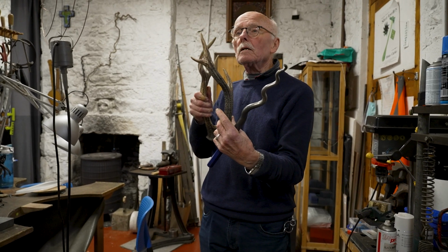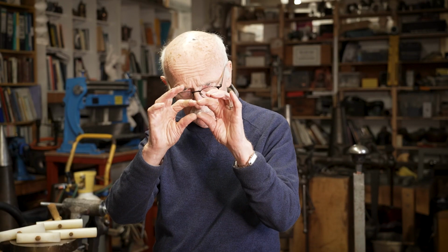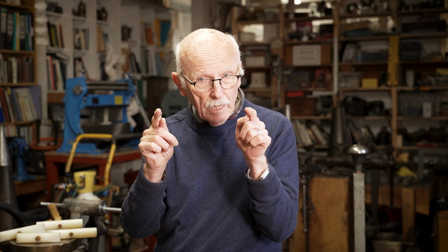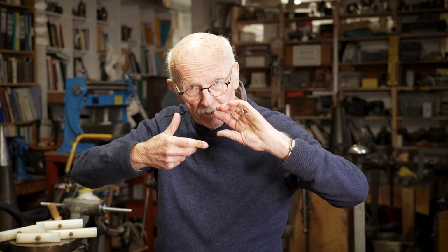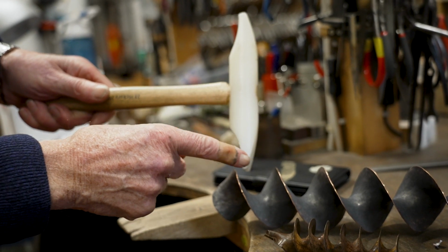It's made of maybe 0.1 or 0.2 thick gold. What one has to do is, you have a strip of metal, you have to shorten the center axis to about half the length, and that makes the edges long and wrinkly, and then you can twist it because you've got the longer edges already there to go around.